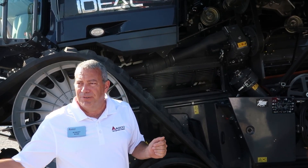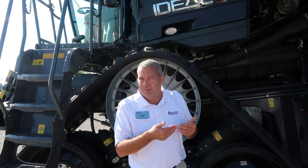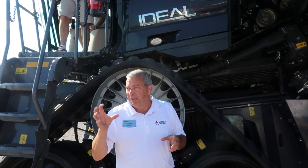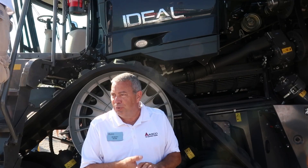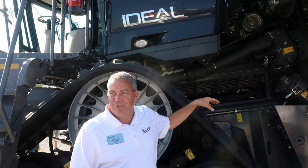This is the first part of being able to have a self-adjusting combine — we have to understand what's going on inside the machine, and the combine has to know. You'll have sensors in the feeder house sensing the flow of material, and we track it all the way out the back of the combine. It also has a camera in the clean grain elevator so we can see our grain sample in the cab or on an iPad while driving alongside. That camera will be able to tell if you've got too many cracks or too much foreign material, and that's how the combine is going to know how to adjust — based on grain loss and where material is coming through the process. The plan is for the combine to adjust itself better than we can and get more productivity.